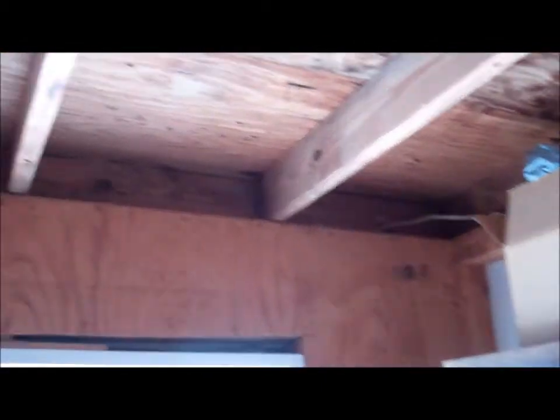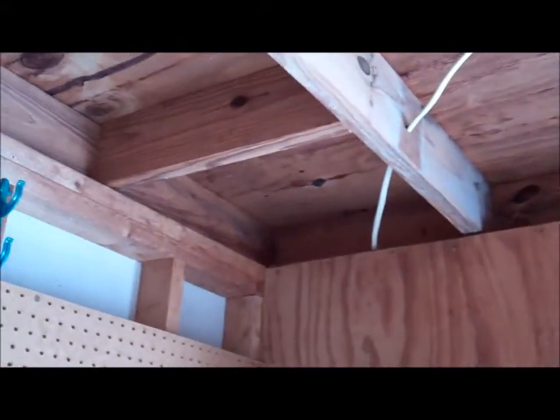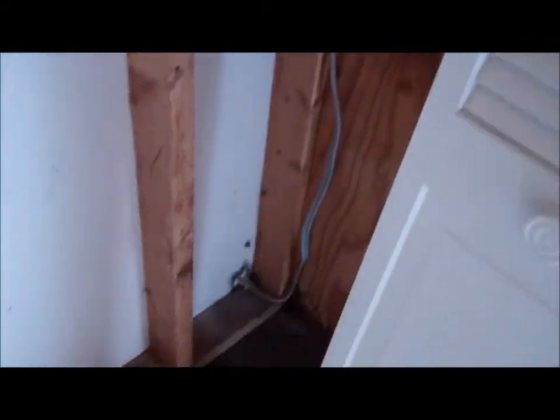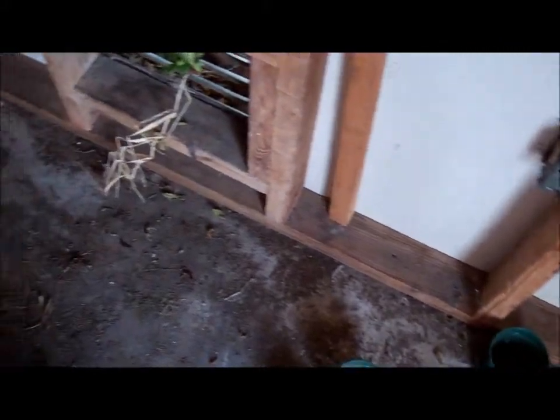You can see at the other end there — he just put his joists right along there and left them there. And then we come along — you have a bunch of exposed electrical, and there's nothing holding the bottom plate. There should be some bolts coming through, or at least a tapcon going into the concrete to hold it up.